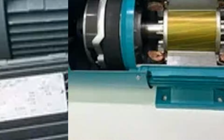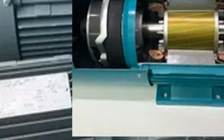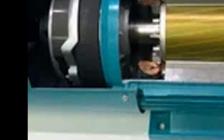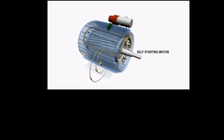The principle of operation of a synchronous motor can be understood by considering the stator windings to be connected to a three-phase alternating current supply. The effect of the stator current is to establish a magnetic field rotating at 120f/p revolutions per minute for a frequency of f Hz and for p poles. A direct current in a p-pole field winding on the rotor will also produce a magnetic field rotating at rotor speed. If the rotor speed is made equal to that of the stator field and there is no load torque, these two magnetic fields will tend to align with each other.